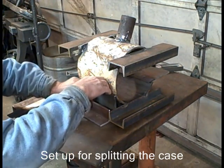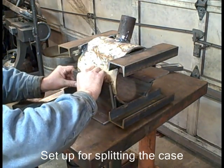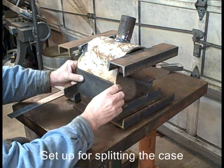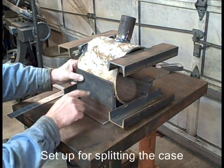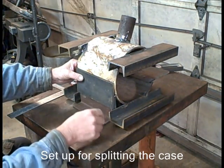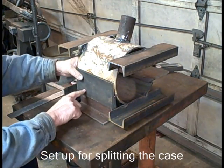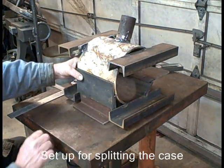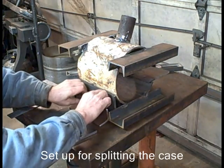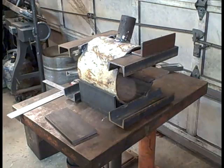Not during its use, but it's going to be made so that the top can be separated from the bottom. I'm going to do that by welding two pieces of plate, one piece to the bottom and one piece to the top, and then drilling two holes in there and having bolts hold the two plates together. The first thing I'll do is weld the bottom plate on, and then I'll cut the forge body in half,